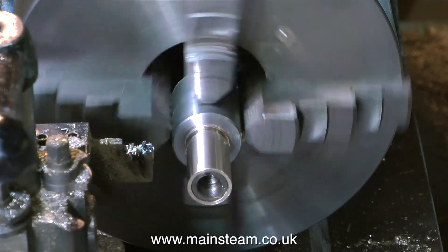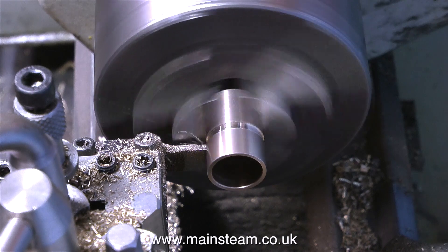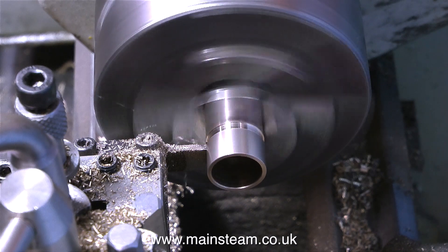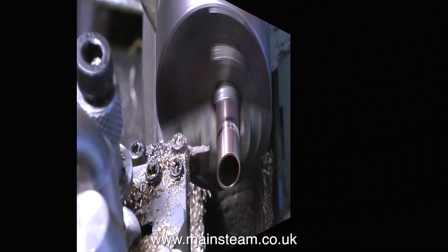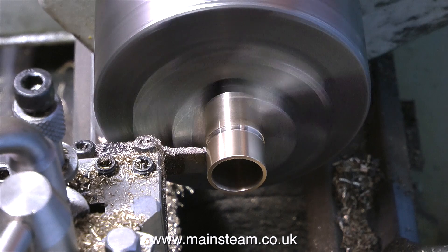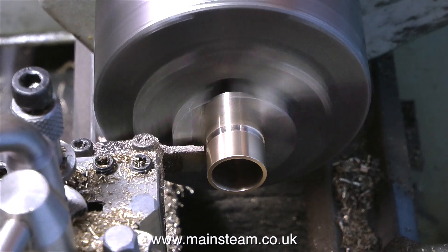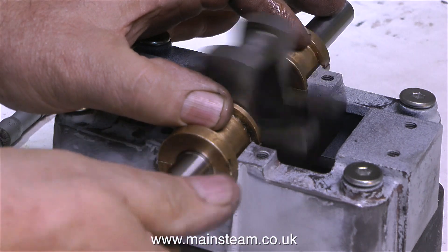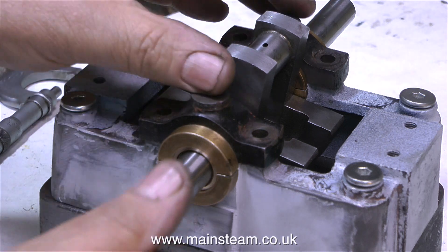Now I have a pair of bearing bushes that fit perfectly inside the original bearings. The next step was to fit these bearing bushes to their respective main bearings and drill through the oil hole. I moved on to the small Boxford lathe and used the parting tool to cut a very small groove around the centre of the bearing bush exactly where the oil hole is. If the bearing bush were to rotate in the main bearing the crankshaft would become starved of oil, but by machining this shallow groove all the way around, the crankshaft will still receive lubrication. It's a belt-and-braces approach. When these bushes become worn I simply make two new ones, and it's much quicker than making a full split main bearing.